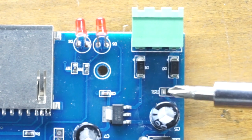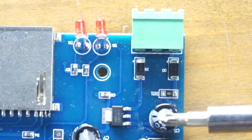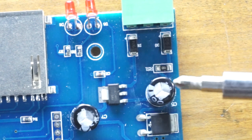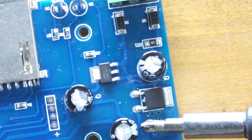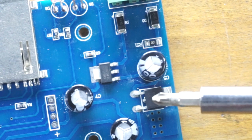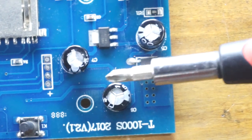This is the current limiting resistor in series with this power input, which protects the circuit and components in case of a short circuit. This is the smoothing capacitor on the 7-to-24V input, and you can see the input trace connects to the input of this 7805 linear regulator, which converts that 7-to-24V input down to 5V.